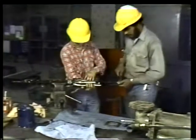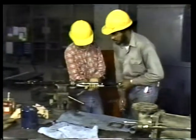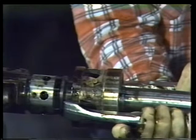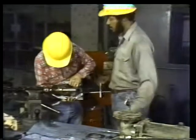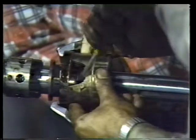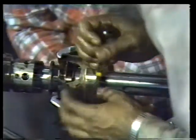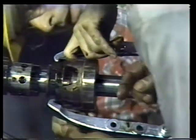When the bearing puller is properly lined up, you can begin backing off the bearing spacer, and stationary parts of the seal. Having someone steady the puller will help prevent the rotor from shifting in the vise. When the bearing spacer, and seal plate have been moved back an inch or so, the inner split retaining ring will be exposed. It must be removed before the other parts can be pulled any farther. Split retaining rings are often difficult to work with. Assembling and disassembling them easily requires a good amount of practice. Just be sure to remove both halves of the ring before trying to pull the other parts off the rest of the way.